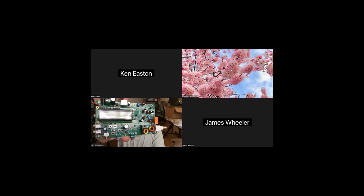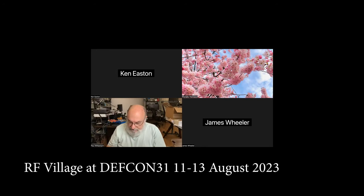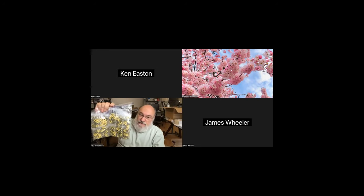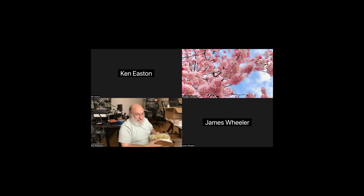We'll build up several more and hopefully have working demos at DefCon. This box contains all — or almost all — the parts for a hundred of them. For example, this bag contains 100 little tiny bags, each of which contains 14 toroid cores, which is what it takes to build up a full set of bandpass filters for the RF BitBanger. I've also obtained several dummy loads to hook up to the RF port so I can operate it legally without interfering with anybody.